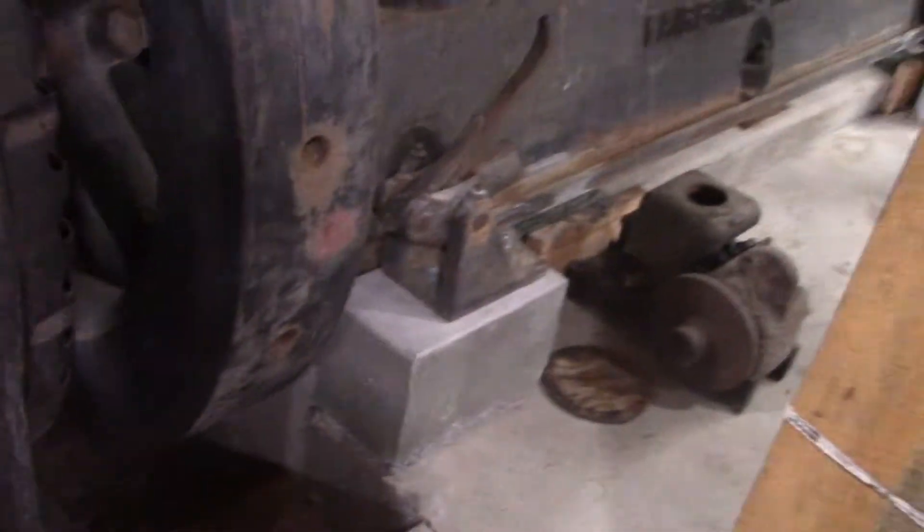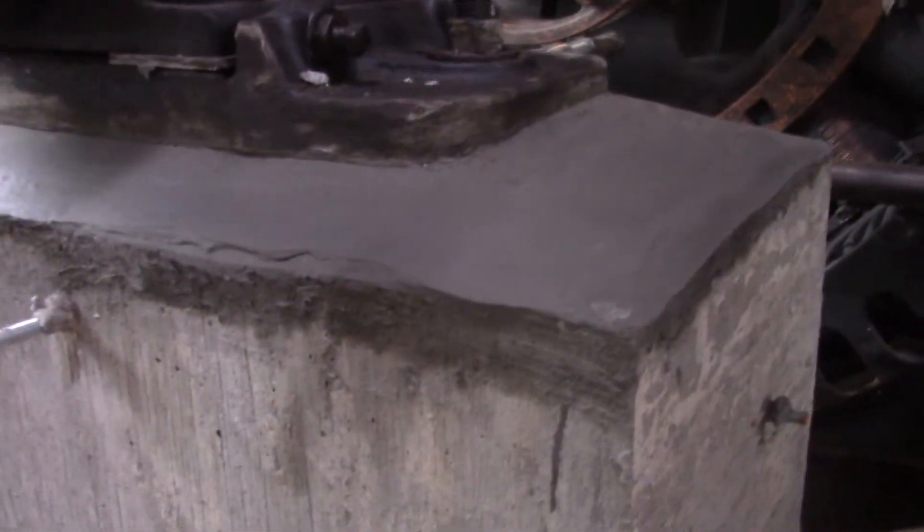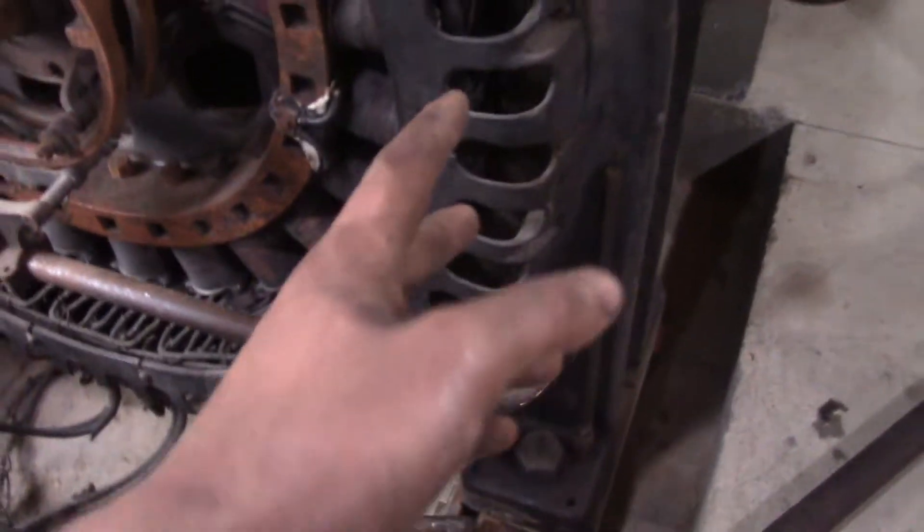Another one of the last things to do is grout in the engine. We started today — we got the outboard bearing all done. Then we have to grout in the base for the stator. We also have to align the stator; it is up on these jacking screws right now. I had to jack the stator up so I could adjust the outboard bearing.